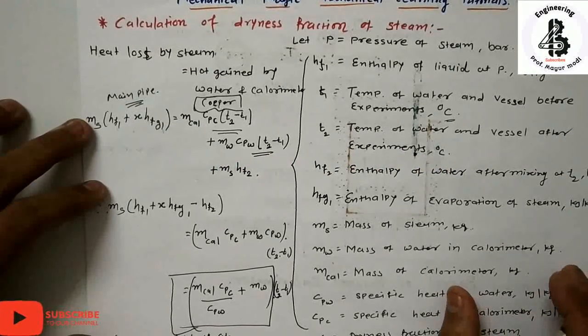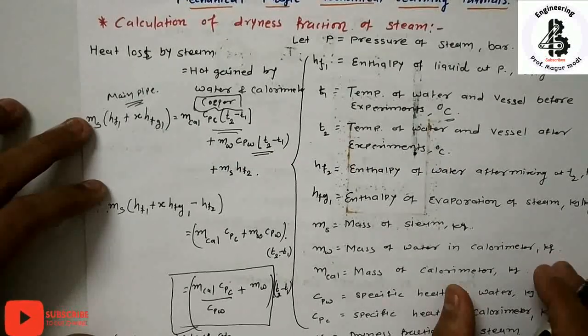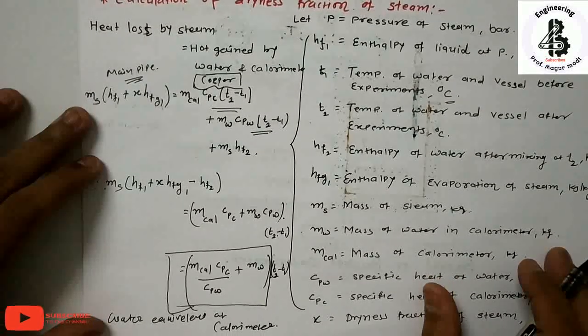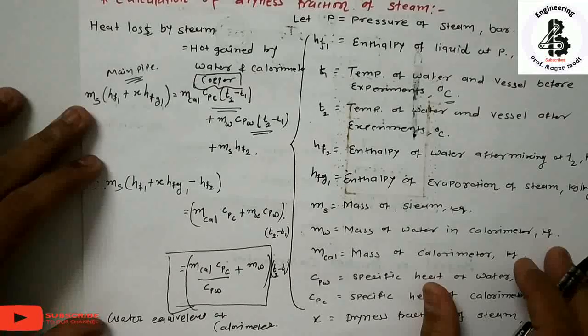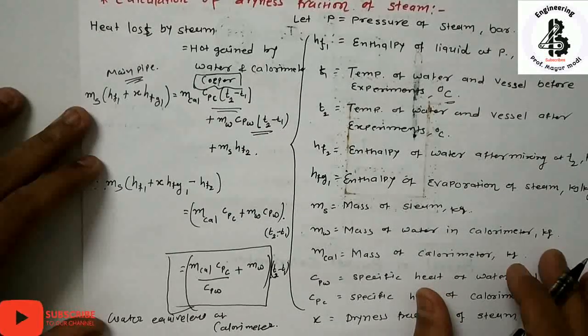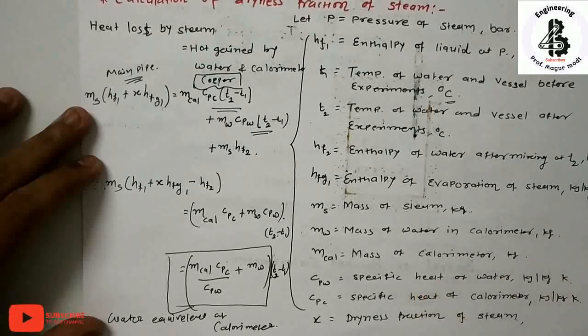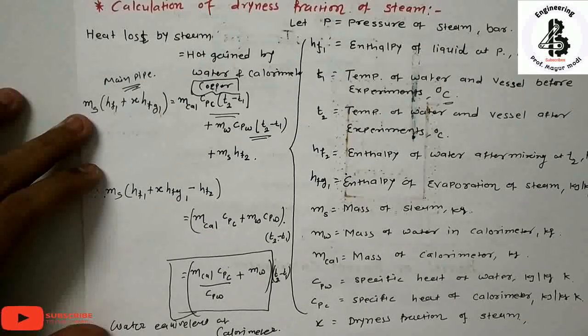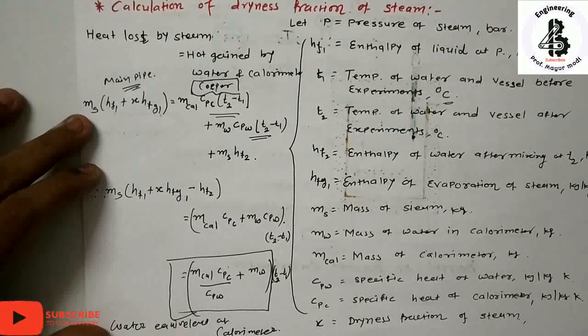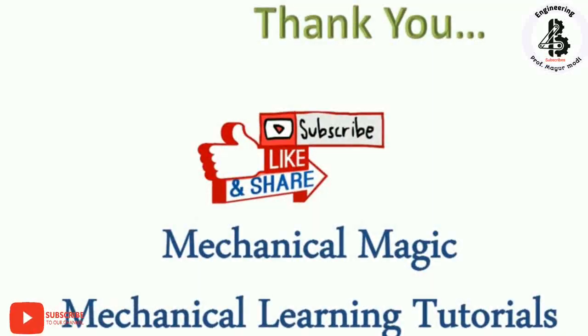Generally such an instrument is used for the measurement of dryness fractions, but this method is not accurate. Accuracy decreases as the temperature difference increases. Such behavior has been found in experiments with the barrel, or bucket, type calorimeters.